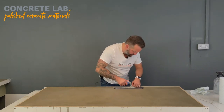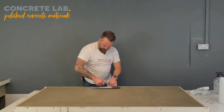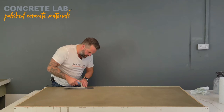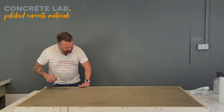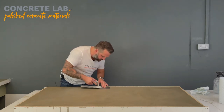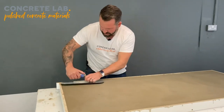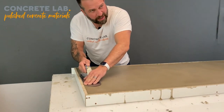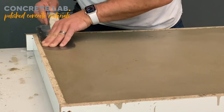On the edges it's quite useful to just use the straight edge of the trowel against the edge of your formwork and just go back and forth to get it nice and smooth. It's not very easy to do circular motions when you're banging up against the formwork on the edge, so just take a bit more time, go back and forth a little more lightly, and eventually it will begin to smooth off.